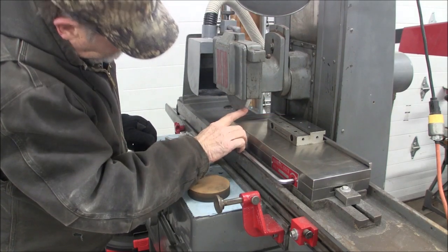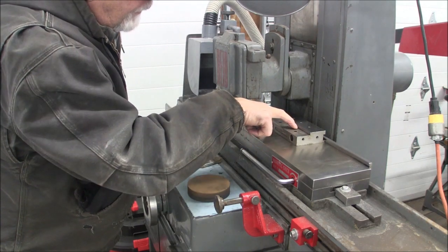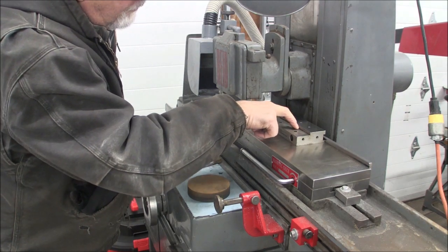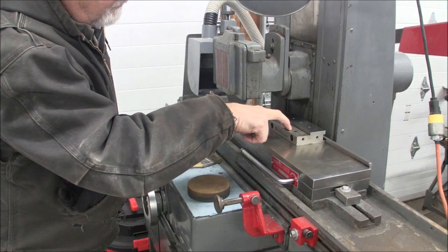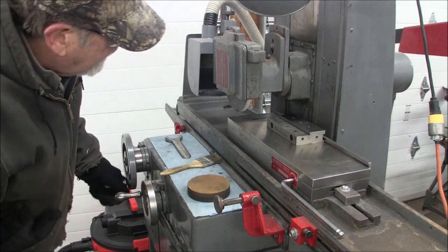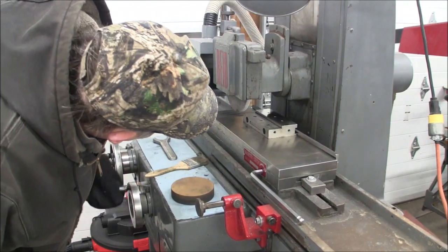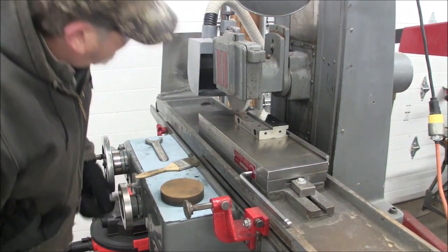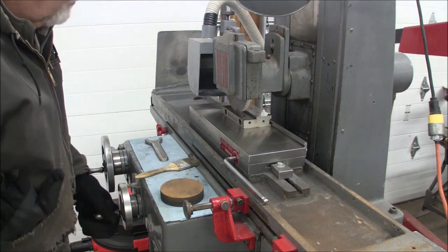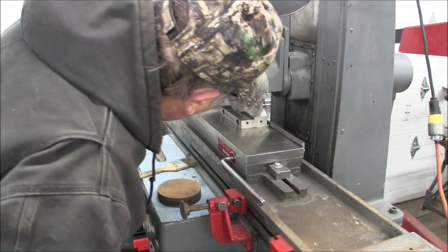The breakdown on my wheel is here, so I'm going to keep working the breakdown on that side. But of course, I can't afford to have any breakdown on my wheel up close to that shelf. It has to be nice and sharp and flat. So we're going to go up close to the shelf and then feed in this direction. So I'm up against the back rail, magnet on, and I'm going to position this close within my eye. Normally I would do this with the wheel on, but since I have to talk to you guys, I'm going to leave the wheel off so you can hear.